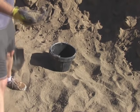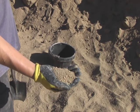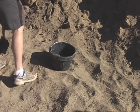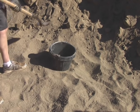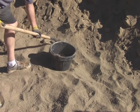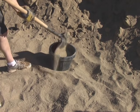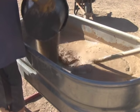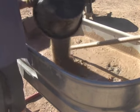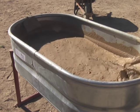The second ingredient is sand. We're using washed concrete sand — it's very coarse, with particles ranging from little rocks down to small grain sizes. That's very important for making strong earthen building materials. We're also going to add seven buckets of sand, so it's a 50-50 mix: 50% clay-rich soil and 50% washed concrete coarse sand. Of course, your soil mix might be different. It's very important to have at least one person mixing while you add the sand, because it tends to clump at the bottom.